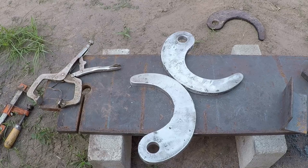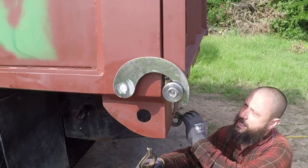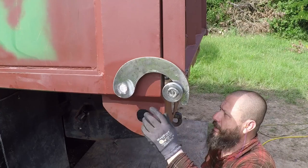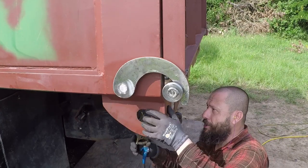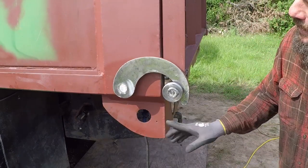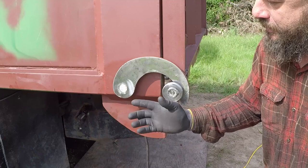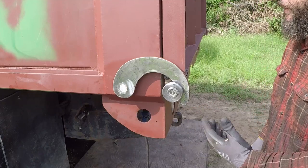They are ground and they're perfectly matched. I'm going to prime the backside and then I will tack them in place. I will hook the ground to this rod so this will not damage the bushing. If I hook the ground on the bed and I try to weld here, it may arc between the bushing and the shaft and this will mess it up. It will not be operating smoothly.